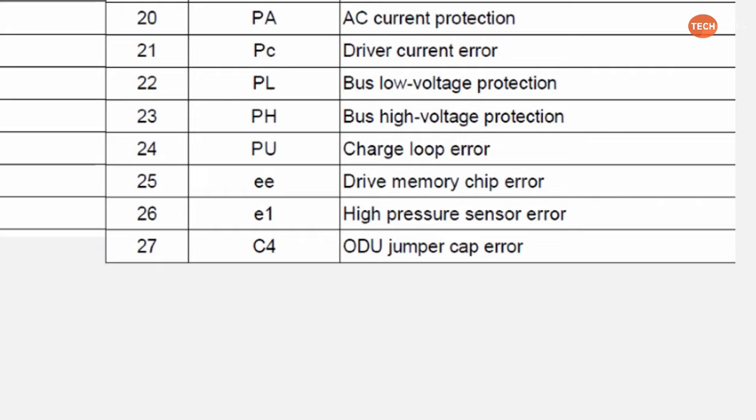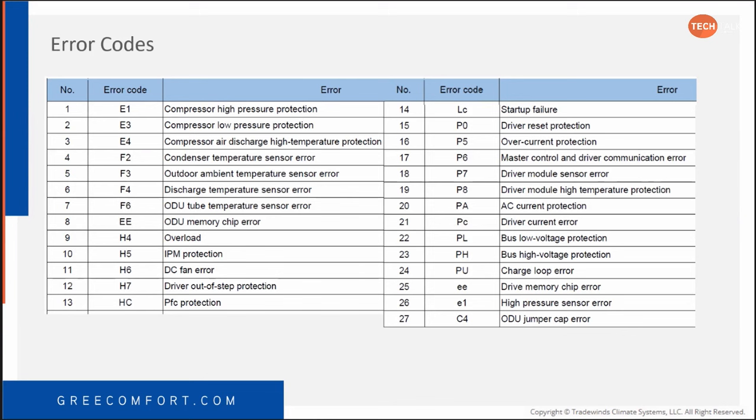On error codes, as we were talking about yesterday, there are different error codes on the Flex compared to the MultiPro, compared to the Mini Splits. Some of them are similar on the Flex and the Mini Splits, but it's important. I recently had someone with an H6 code. H6 on the Mini Splits is indoor fan motor. So the technician was already going down the troubleshooting route of what's wrong with my indoor fan motor.